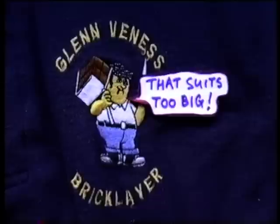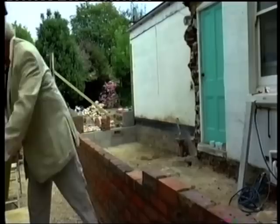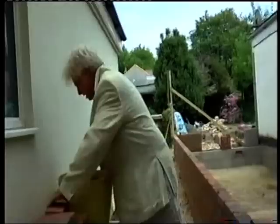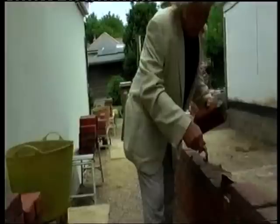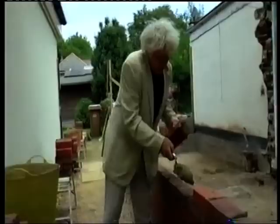Just enough pug for one brick - no tapping of the bricks, nice full joint, just one brick at a time. No tapping. We're both retired now but we need to pass on this way of laying bricks. That old way of spreading the pug is hard work, and this way you can see all along the line.